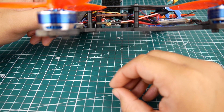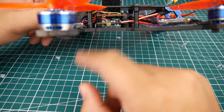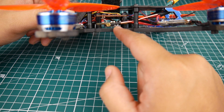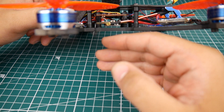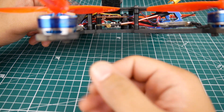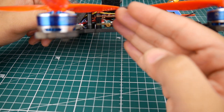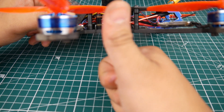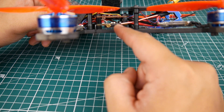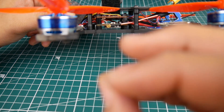I'm very happy I actually did this because it proves to be one of the cleanest, most beautiful stacks I've ever seen. Usually on a quad like this you'd see the VTX up here and the receiver somewhere else. But here it's just a two-stack and you have basically everything in them. The bottom stack is the PDB and the VTX, and it also supports the Tramp protocol, so you can switch your VTX power and channel through the Betaflight OSD — which is a big plus. The top stack is the FRSky F4 flight controller, which has the XSR receiver already built in and soldered. So that's four components across just two boards, which is absolutely awesome and keeps everything very clean.